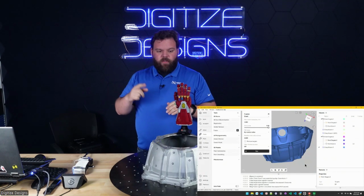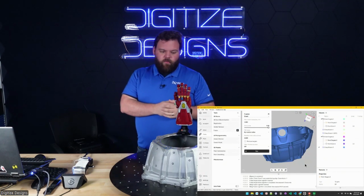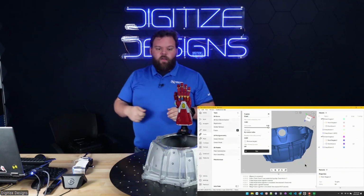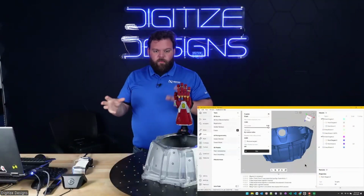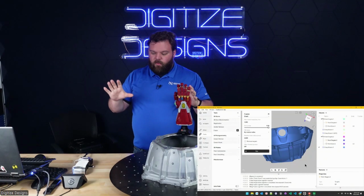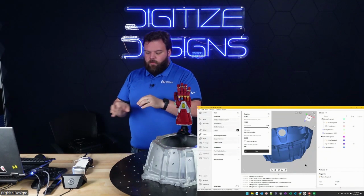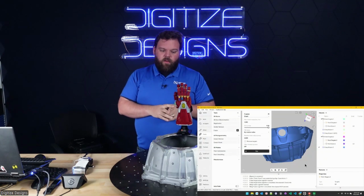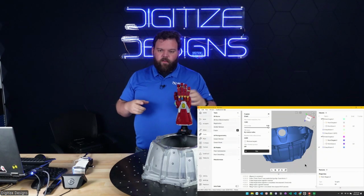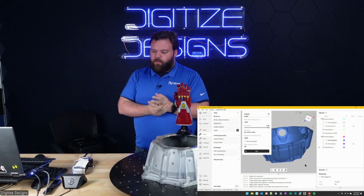You scan the object, take a bunch of photos or one video of it, basically take a video and do a couple loops around it, hit it from a few different angles. And then you can make those both into meshes, combine them together, and basically colorize the really precise geometry that you're going to get with the Point using those photographs. And I've got an example of that. We won't run through the whole process because photogrammetry takes longer to process than I'd want you to have to sit and watch me do on this webinar.